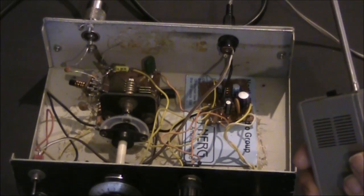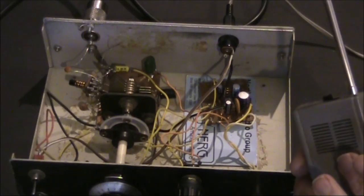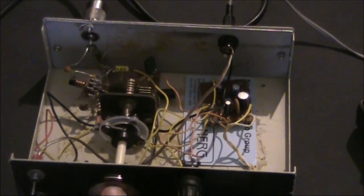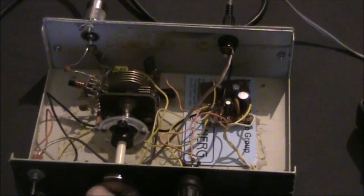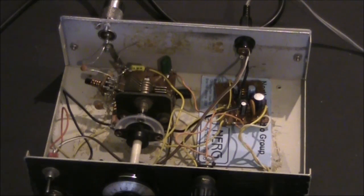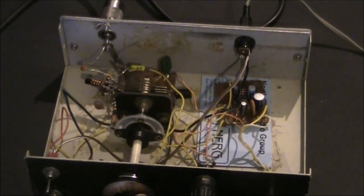I'll do a demonstration with this 27MHz AM walkie talkie on 27.145MHz. As you can hear from the hiss, it's also a super-regen receiver. This is the super-regen receiver. I'm transmitting AM with a 27MHz walkie talkie on 27.145MHz. I'll just tune in a little bit more — there's a bit of backlash because I haven't anchored the board that the variable capacitor is connected to.